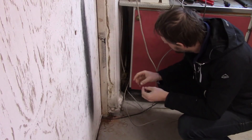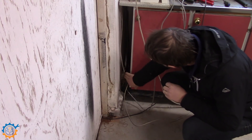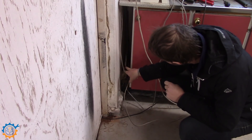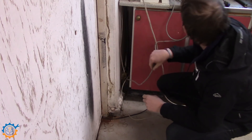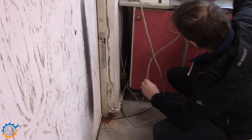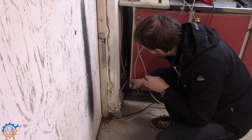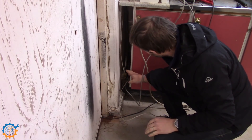We basically need to get the big cable in here. Inside we have two pipes going in — one for the thick wire currently in use, and one smaller that is only holding some kind of ethernet wire. I think this is the old one, so we can scrap that and utilize that other pipe. To do that we need to dig out a little bit more on the outside, so let's bring the excavator out and get hold of that one.